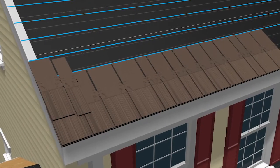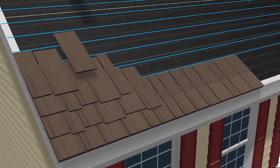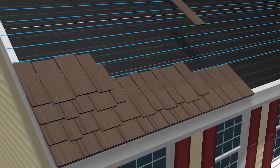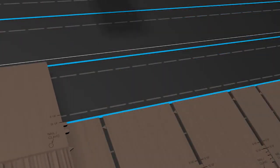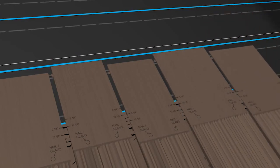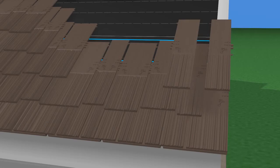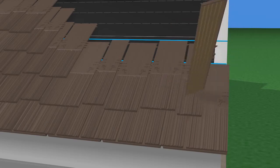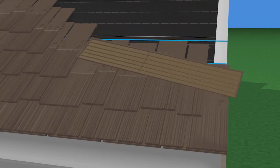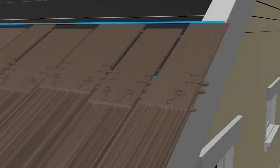Continue placing the shakes horizontally, altering sizes, and maintaining at least 2-inch joints over the seams in the previous course. Alternate the shakes, placing one on the chalk mark and the next one 1 inch below the chalk mark. Note that if the course ends at an open edge, you should cut the shake along the closest vertical rib so as to show a closed edge from the ground. Cut off the outside alignment tabs.